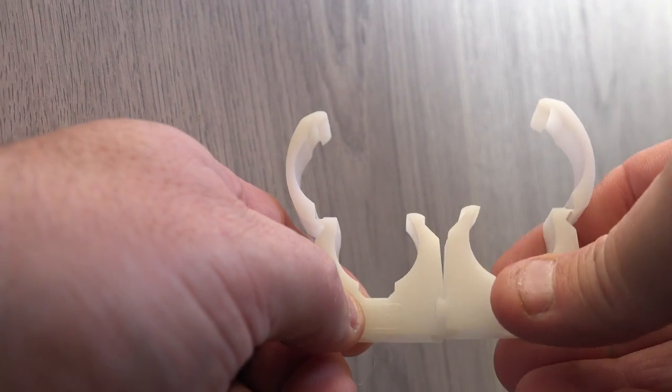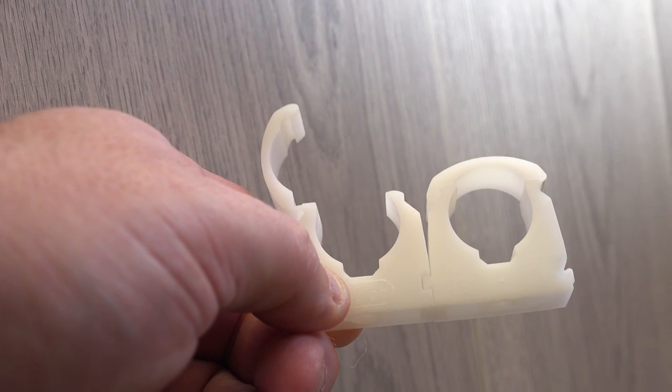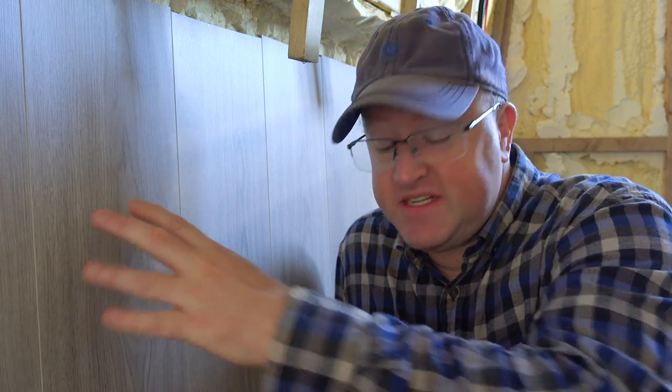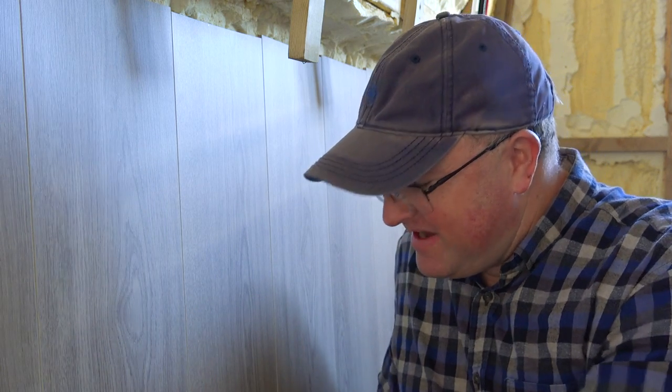I've got three pipe connectors that all snap together, with a snap on top as well, and I've screwed them all down and spaced them accordingly. All the pipework throughout the whole boat on both sides will be on the floor, and then I'll put another batten on the outer side with angle joins on the edge, and probably use some offcuts to make it go out and down. I'll have to line the lines up perfectly because my OCD will kick in otherwise - I'll be lying in bed annoyed if they're not exactly aligned. I'll make a nice trunking that I can remove to inspect the joins whenever I want.